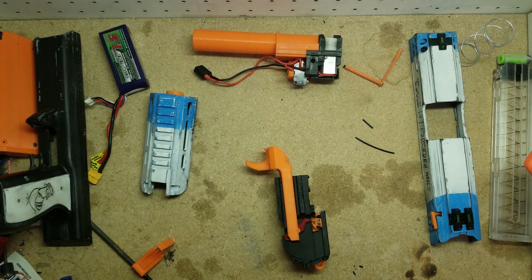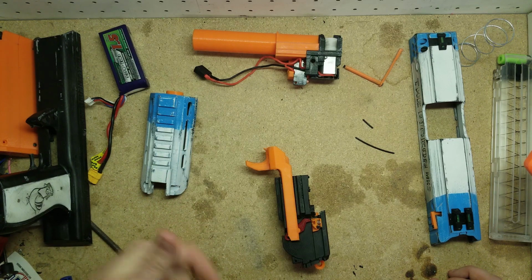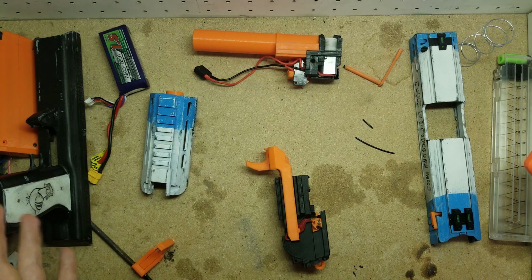this was the scenario that I'd predicted would happen, is that you draw it, you try and fire it, but you wouldn't have it revving because you hadn't squeezed it right. And if that was an actual safety, like an electronic safety, that wouldn't happen because it wouldn't rev without the trigger being pulled. Because they were independent, you could actually fire without revving, and I did just that, and then I revved, and it jammed and burned out my motors. There was smoke and everything. So that was my first sign.